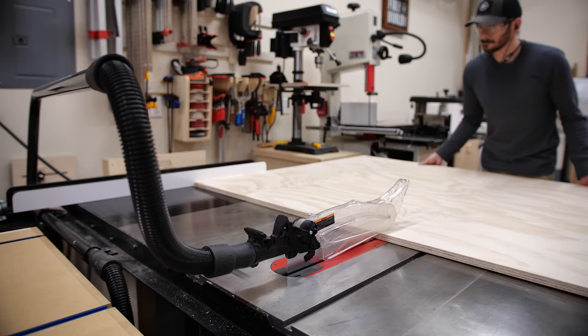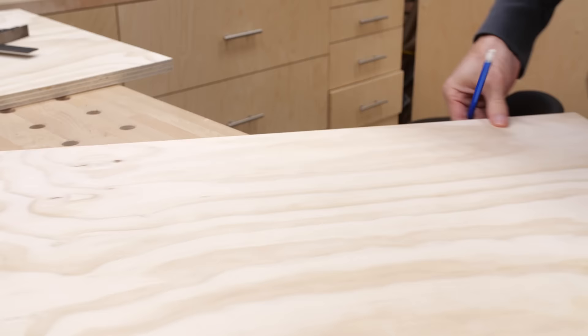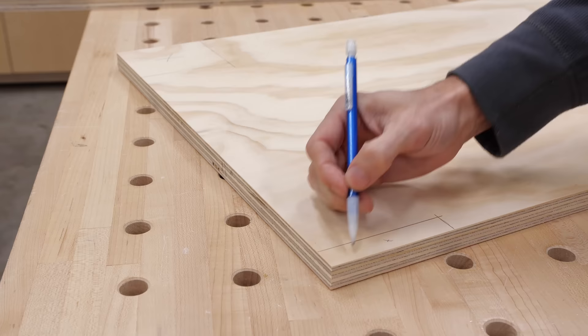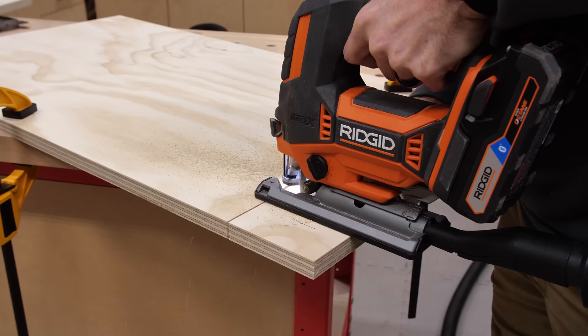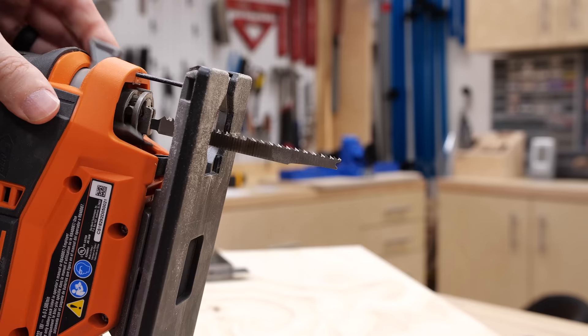The first piece I'm building is the base of the center unit, which will have four drawers and be like a small dresser. I cut the parts for the carcass and then took the sides to my bench for some notches. I made the layout lines for a toe kick on the front of the dresser and instead of having to cut out and remove the baseboards, I'll cut a notch in the back to go around them. A jigsaw makes quick work of the toe kick. When cutting tight curves with a jigsaw it helps to have a nice thin blade — I started with a larger blade and it couldn't make the turn, but I switched to a thin one and it worked way better.